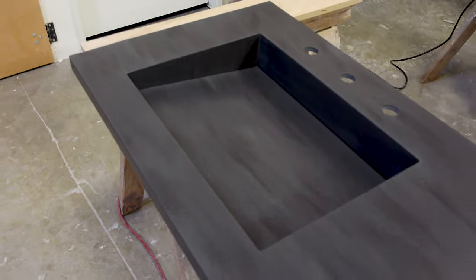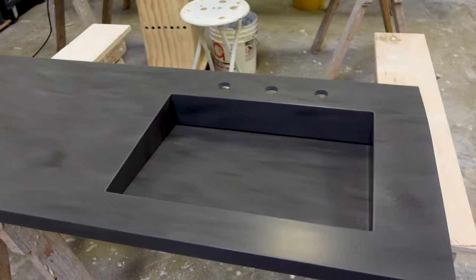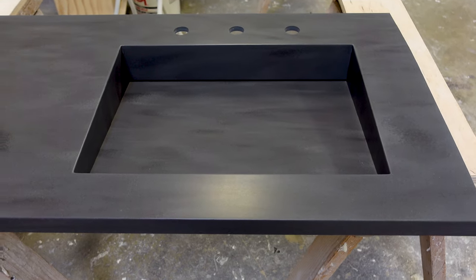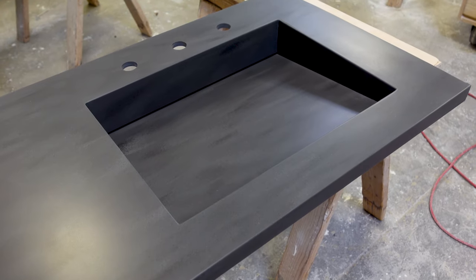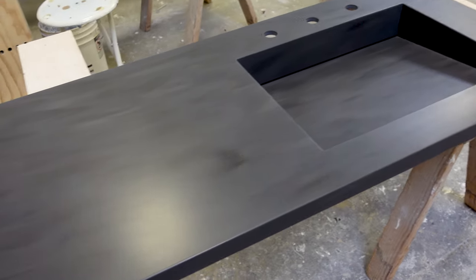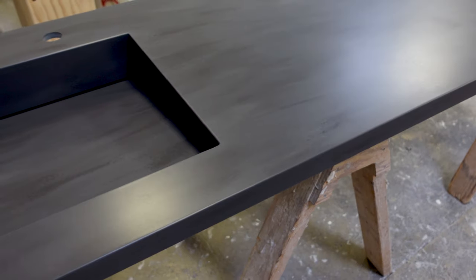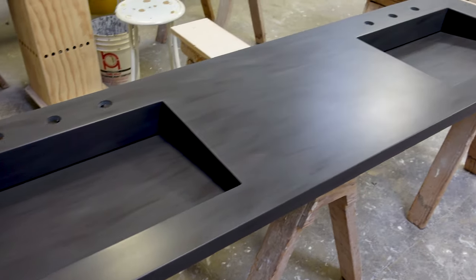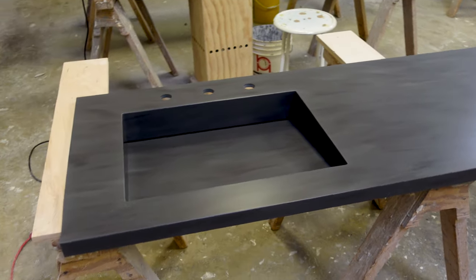And again, if you've seen earlier on in the video where I said I had already sanded all the sink parts, you basically have to re-sand everything because there's just scratches and stuff and it gets uneven and it doesn't look consistent. But you can see this will give a nice satin finish. You kind of see the shine across it. It's not going to be shiny, but it's not a matte finish, the 400 grit. The maroon Scotch-Brite kind of tones it down a little bit.